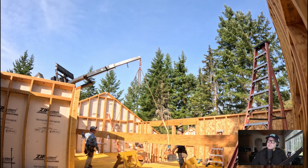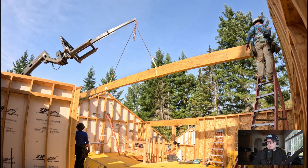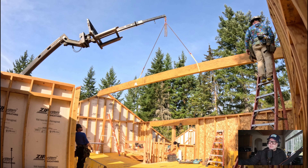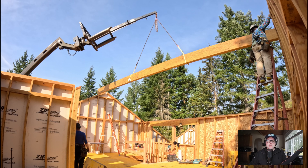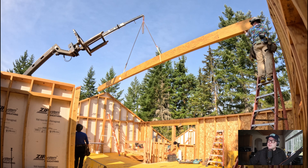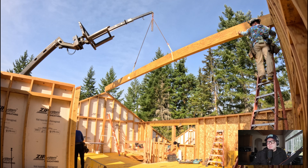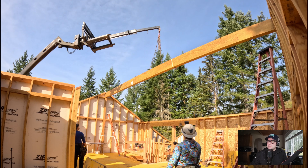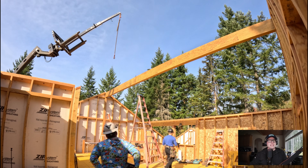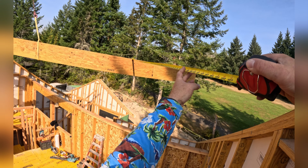Let's set this bad boy. I'm going to show this from a few different angles. We have our rigging points roughly in thirds and we can pivot on the truss jib. The problem is Kyle can't see me, so I have to call out signals and tell Jordan what I need him to do — he'll translate that into signals for Kyle. I don't have a tagline so I'll just use my tape measure — it's like the world's best tagline. Kyle had it really close, but I was making some mistakes. We're going nice and slow. I have a 12-foot very stable tripod ladder and I'm like three rungs down from the top, so there are no safety issues.